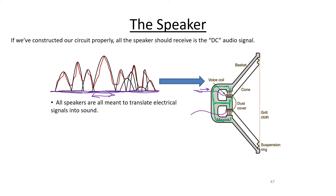That permanent magnet provides a fixed field — you can imagine a north here and a south there. When the magnetic field created by the voice coil interacts with that fixed field, you get motion of the whole voice coil back and forth. If it receives a current it gets kicked out in one direction, and when the current goes away it comes back. A regular set of pulses causes this forward and back action, and since the voice coil is connected to a membrane, the whole thing vibrates mechanically.